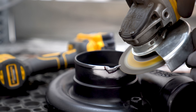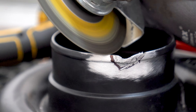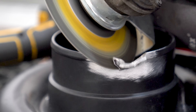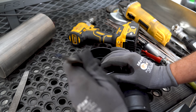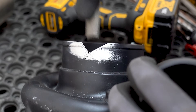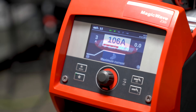Cutting the damaged section out was a job for my cutoff wheel. There are several other tools you can use for this instead, but I really like showing the simple tools in action when I do these repairs. Cleanup is done with a file because I do not want to damage or grind away the metal around the damaged area as it will disrupt the contour itself. The file allows me to just touch on those areas that I need a good cleanup on.